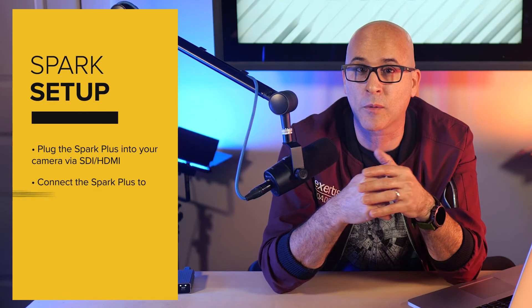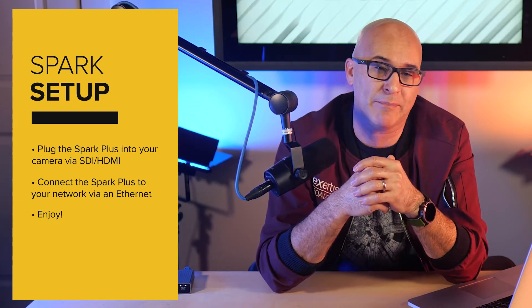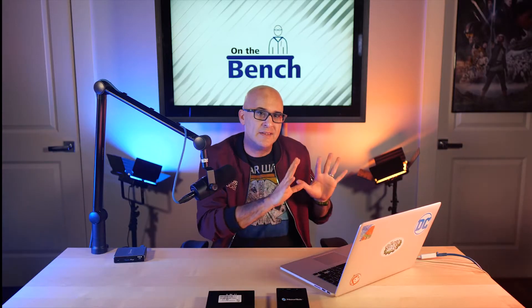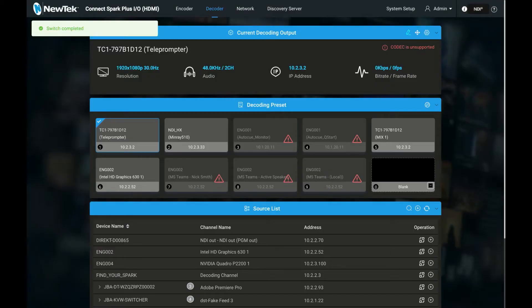As to why you need one: how many times has someone said 'we need a camera over there' and you didn't plan for one? In a traditional SDI infrastructure that's not always convenient or even possible. But with a Spark Plus in your pocket, find a network port nearest your camera and you're done. The Spark is the perfect tool for the last-minute laptop add-on, a camera in the rafters, or even when someone walks in with content from a baseband switcher. We also see these as a bridge between AV over IP systems from Lumens, Crestron, Kramer, and many others.